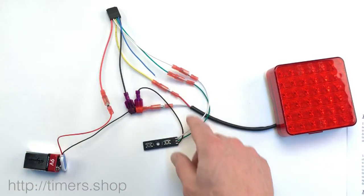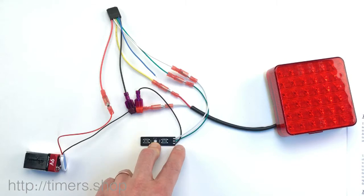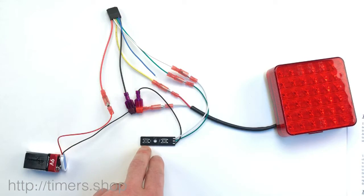The configuration wires are connected to the optional configuration board, which are just two buttons that connect those two wires to the ground. Button one is the white and button two is the green.